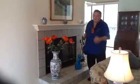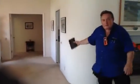Okay? Front doors, they were fine, no problems there. There's a fixed transom window up over the top. There were no problems with that. And again, the only window in the house that we had a problem with is the southeast bedroom. So we have the master, we have northeast and southeast. Southeast bedroom window didn't stay open without assistance. That was the only defect we saw in these windows, okay?